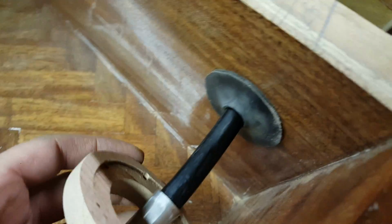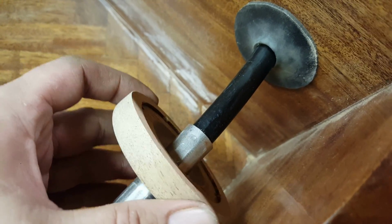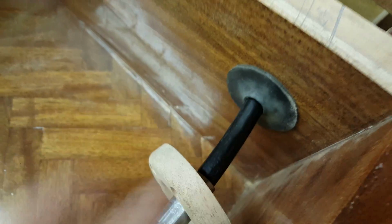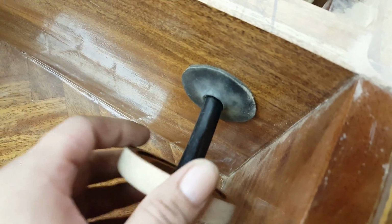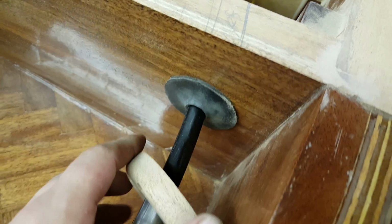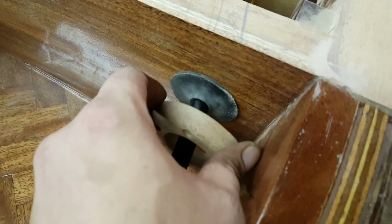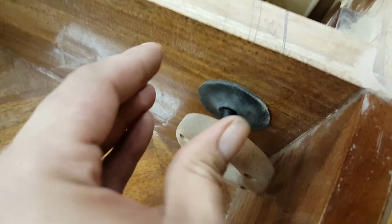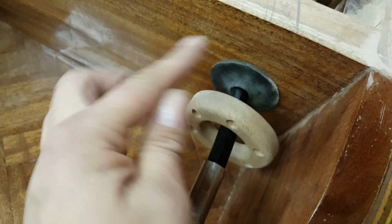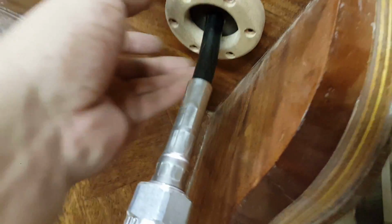And then on the back side, you can see the recess where I used my router to recess not quite the full thickness. Basically, I left about, I don't know, 80 thousandths or so of the rubber thickness not compensated for. So when this is bolted up tight, you actually got to snug up the screws to pinch it all the way tight. So it'll make a fantastic water seal around the outside, because it's not quite that tight. But that's my little bulkhead fitting.